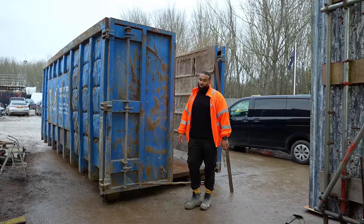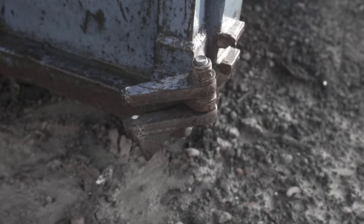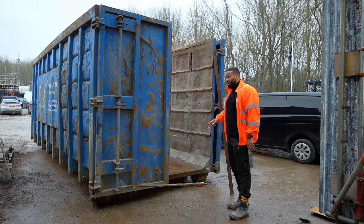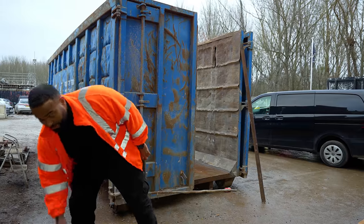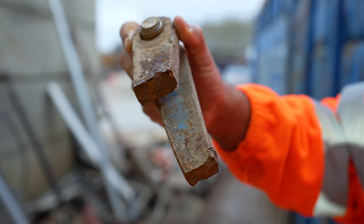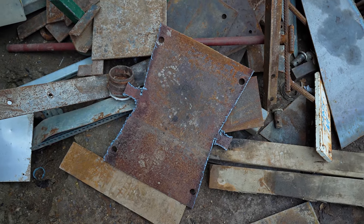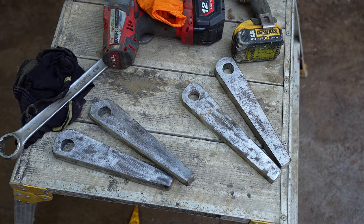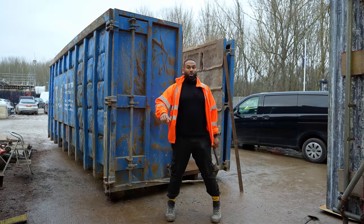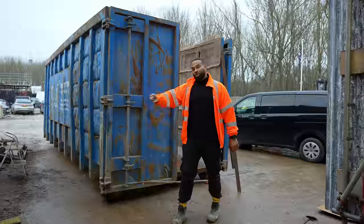Having a look at the back doors on this bin — if you remember, I told you this hinge was gone. What's happened is since we've been using the bin, because there was no hinge here, all the pressure was put across the bottom and it damaged the hinge on the other side. We don't have a hinge at the bottom anymore, but what we've done is take a 25 mil plate, cut it out and made these so we can now use the four of them to replace that side and that side. Then we're going to work our way through the bin, fix all the little bits, and spray it black.